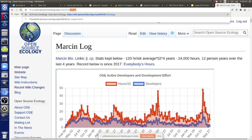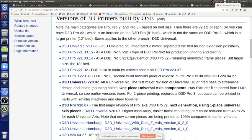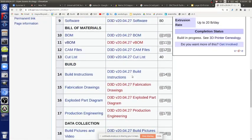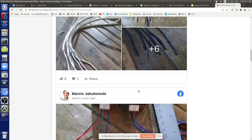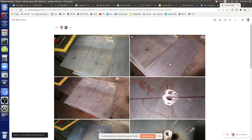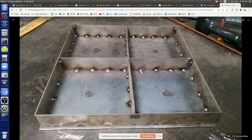Looking at the 18-inch bed printer as an example: the bed has large steel with reinforcing welded on the inside — that's how you get a relatively lightweight structure. We can also use our halogen heaters here, which is an improvement over the nichrome heaters used before. We have a 3x3 ft plate; for 4x4 we'd have to cut it from a large sheet.